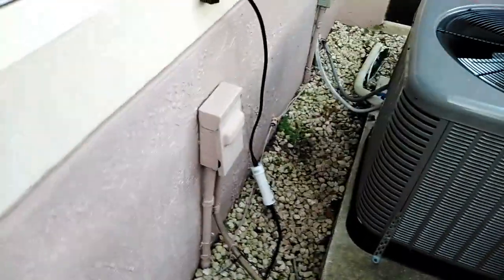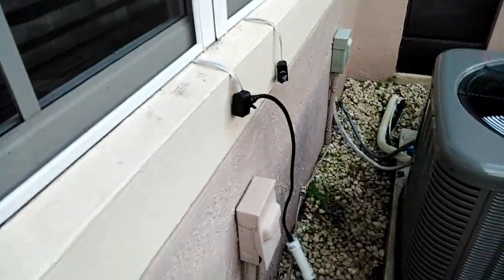As you can see here, I do have a grounding rod and the grounding strap, and then it comes around and goes into a one-to-one choke, and then it goes into a window pass-through feed, which is made by Comet, and then it goes directly into the shack, also being fed by LMR400.